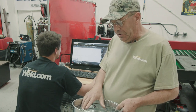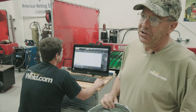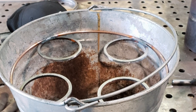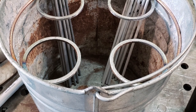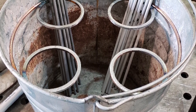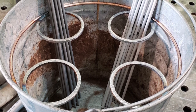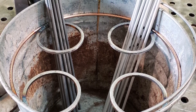So if you don't have a CNC, you can cut these out with oxyacetylene, lay it out. I made one where I bent some filler wire — I took 5/32 filler wire and bent it in a circle. I took some three inch pipe and cut them about an eighth inch long on a band saw and tack welded them in. You could put another piece of filler wire in there, anything that's functional.